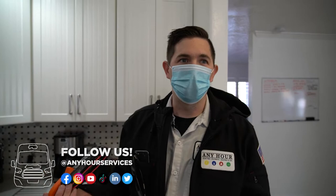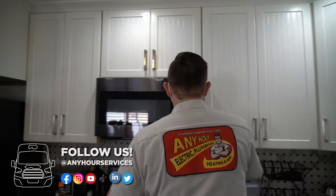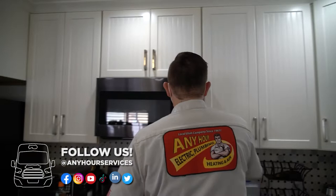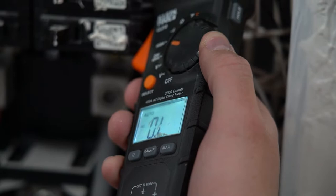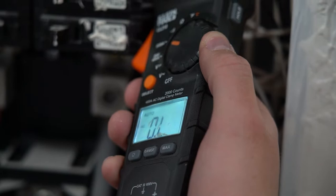As far as the outlets we've looked at, we had the loose GFCI — that's not the cause of the breaker tripping. We're gonna test the microwave with the coffee maker just to make sure we have full usage of the circuit and measure the amperage. We're using 27 amps, and this is a 20 amp breaker, so no wonder it's popping if both are being used at the same time.